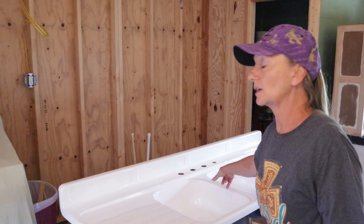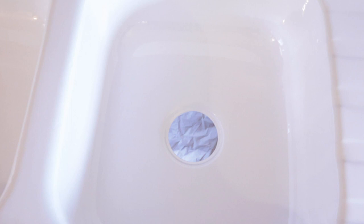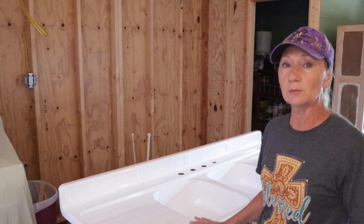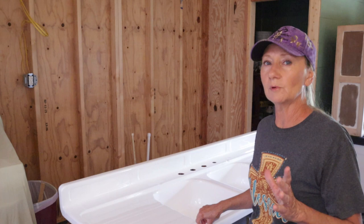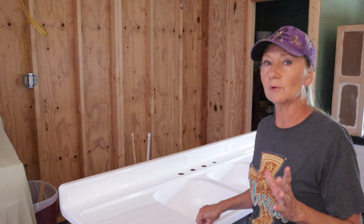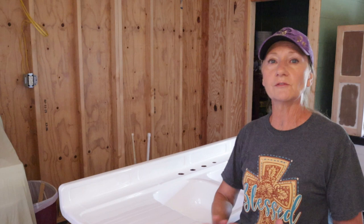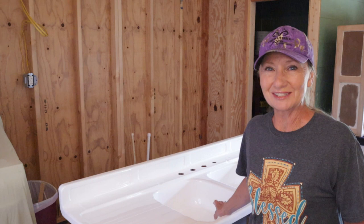For your drains — you can see the openings for your faucet and drains — I did nothing to those. You want your product to flow all the way down to coat the edges because that's where you're most likely going to have rust. One of the selling points on this sink, besides the price — I think it was $100 — was that we also bought a steel bathtub from the same gentleman. When looking for these sinks, check for rust around your drain. Too much rust, or if any drain material is missing from rust, you're going to have problems — it won't seal and it will leak. This one was in almost perfect condition.